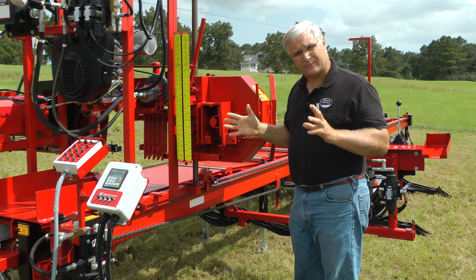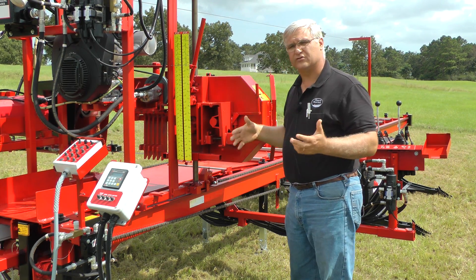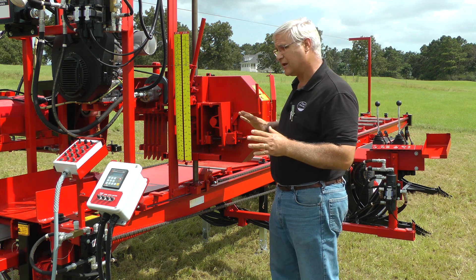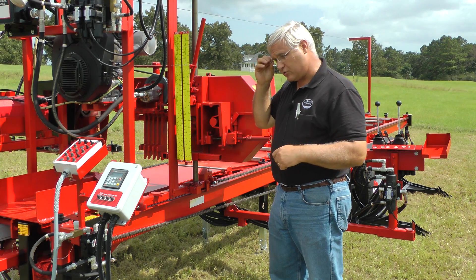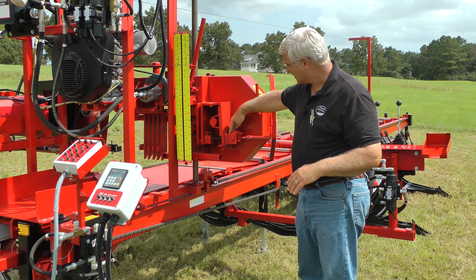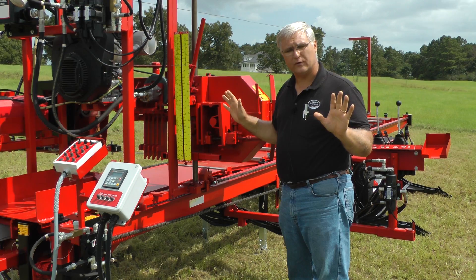If you change band blades, sometimes the amount of tension you put on it comes into play, and you may have to deal with it a little bit, according to what the manufacturer recommends for pressure. The more you tension it — that's the trick I'll show you in just a minute — the more it will move forward. And the less you tension it, the more it will move back. So you can do a little bit of tracking with the tensioning. When you stretch and pull tighter on the spring tensioning device, that affects how it tracks on both wheels.